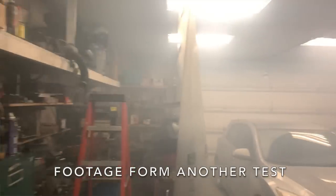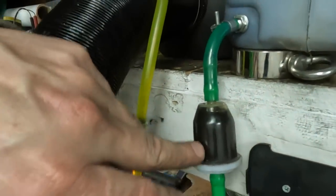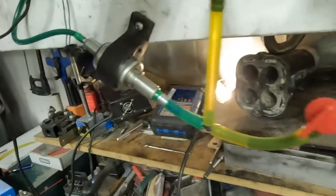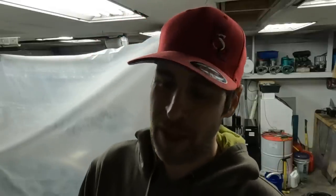I find that quite interesting. I play with this heater a lot and I know that at these temperatures that exhaust would be showing a bunch of smoke if not for the catalytic converter. So just to show you guys, we've got the line coming out of the tank into the fuel filter — that's how black the oil is. This valve is on. You can follow the line through to the fuel pump. It comes out of the fuel pump, the oil is preheated, it goes into the preheater, and it comes down and out here. Now that we've verified that the catalytic converter actually is doing something, let's turn the heat setting down to four and see if it makes a more reasonable heat.